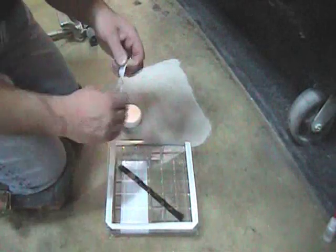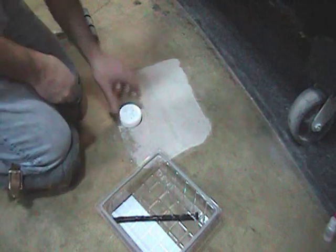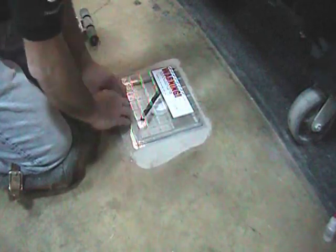The test we are using comes with sealant on the plastic cover. Peel off the tape to expose the sealant. Place the plastic cover over the test area and firmly press down to seal to the floor. We are using a hand roller followed by tape to ensure an airtight seal.